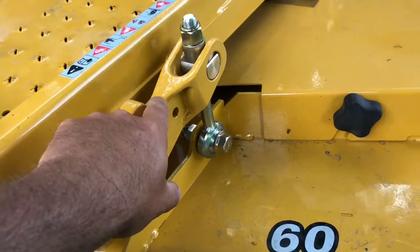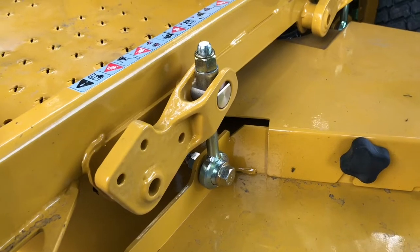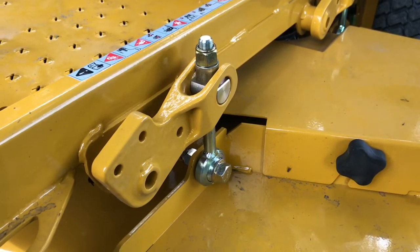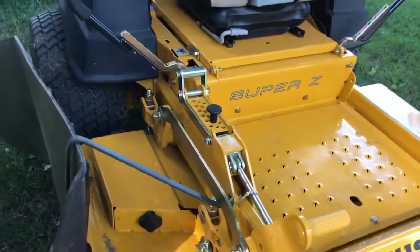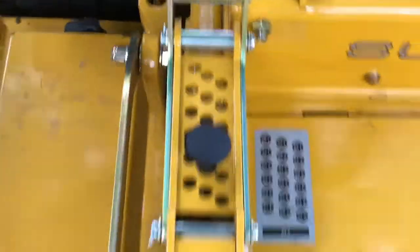I love the way they've got it hung. A lot of manufacturers are going to that. Chains stretch — the bolts that chains hang on waller out, wear out, go bad, bend. Trying to level a deck hanging on chains after they've stretched unevenly — not easy. I am a fan of the hanging system for this deck, and a fan of that height adjuster.